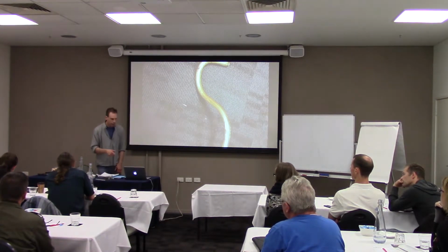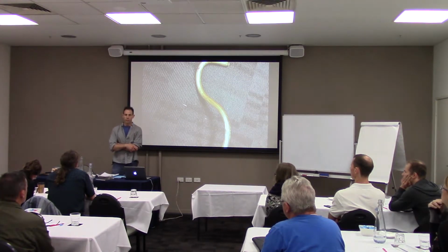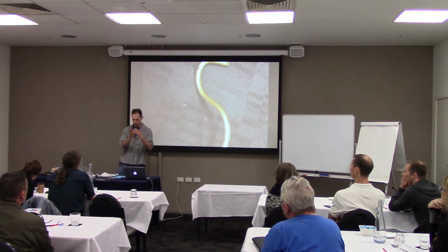Again, on your lathe, if you're making stuff in your shop, I make with the hydraulic press, you can make pad cups, but what I've ended up doing now, to remake pad cups for destroyed saxophones or whatever, I spin them. So I just take a Delrin stock, and you can turn it to whatever diameter you need. Make sure that you don't want to cave it in on itself, but you want a slight bit of an angle. And you can put that between your tailstock, and spin it, anneal it often. But that'll give you a beautiful pad cup, actually.